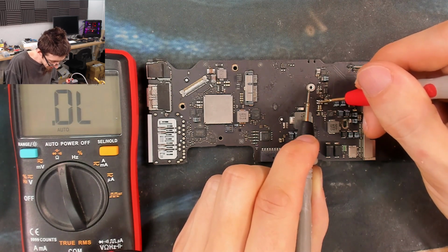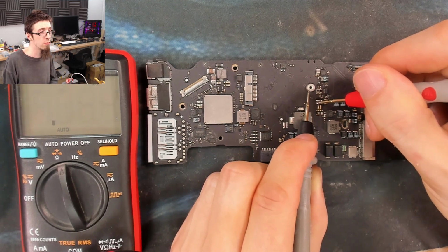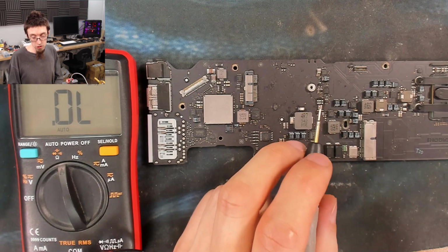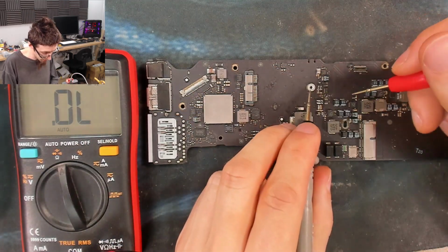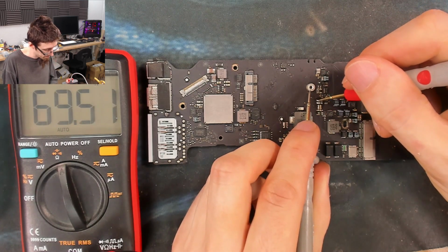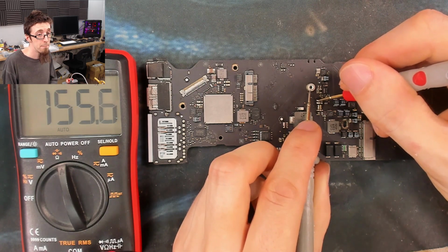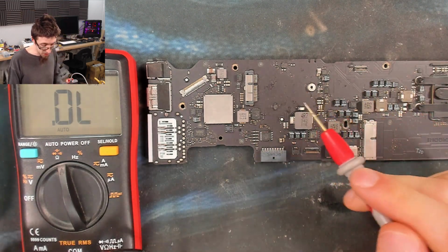Although my heckin' multimeter still has a mind of its own. This is a ranging issue. This is why a lot of people scorn auto ranging, because you can get very odd results. However, a lot of this is just bad probing and stuff like that. The point is, it was showing kiloohms. That's what I care about. So what about the iSense side? Yeah, there we go. There's our low resistance again. So we're getting somewhere. It's on the computing side.